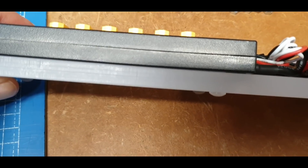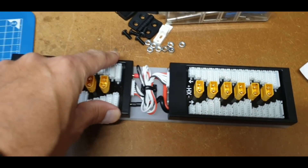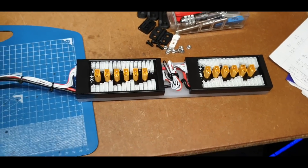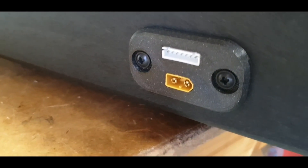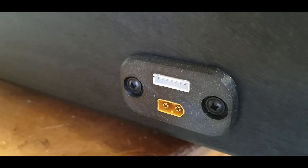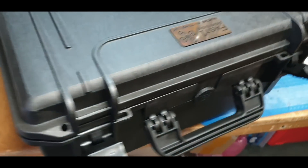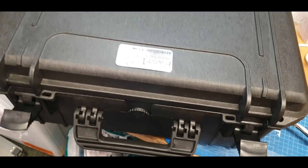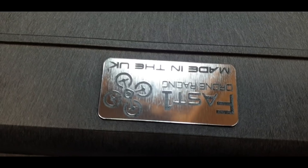I've put some little rubber feet on there as well, just to stop the board sliding around on the plain plastic when it's down. And obviously because there's two cases, there's four of these produced - a pair for each case. The other one is on this side and I've left it disconnected. You can see where it will plug in. We can go up to 6S LiPos if need be, because you've got the 7-pin JST-XH connectors there, so the PL6 can be used to its full potential if need be. There's also a LaserX logo on the front which just finishes it off.